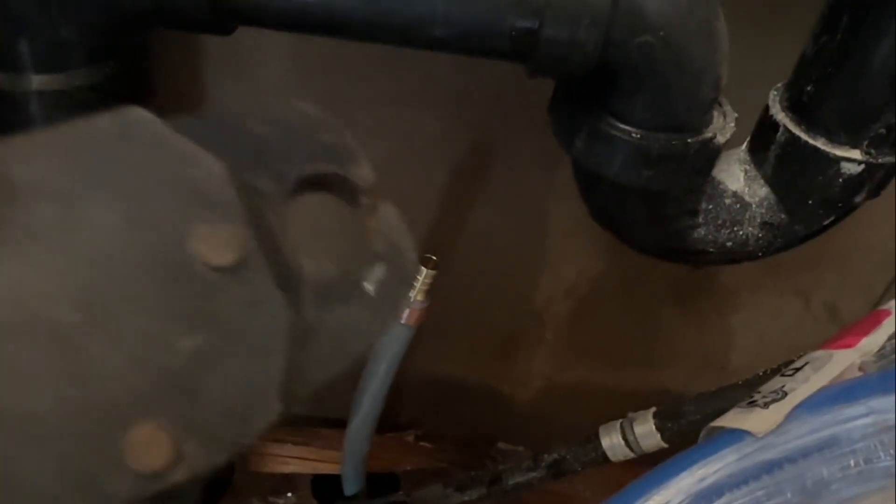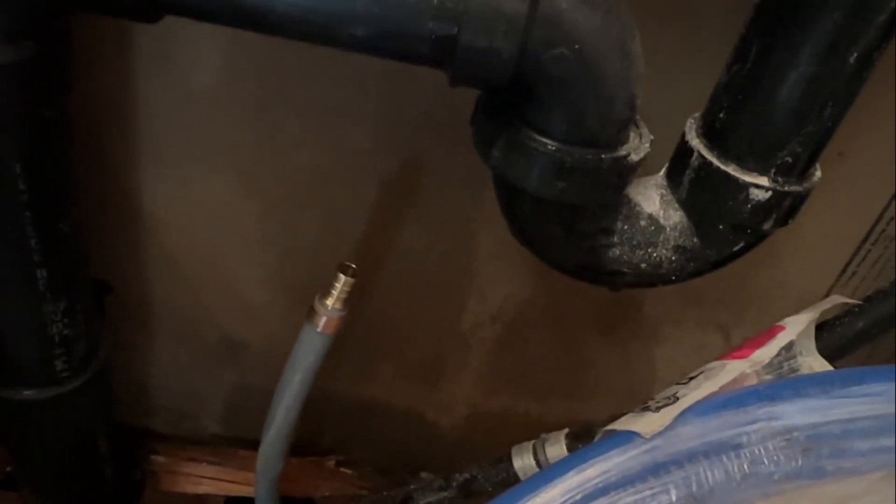So this is how we do it — stuff the insert down in there. A lot of people say don't use the same crimp tool for polybutylene, that you need a separate crimp tool. But this is all I have for now, and a lot of guys do use the same crimp tool. We'll check carefully, and if it doesn't work we'll wait until next week and go to a plumbing supply store to buy or rent another crimper. But we've got to get the water turned back on.